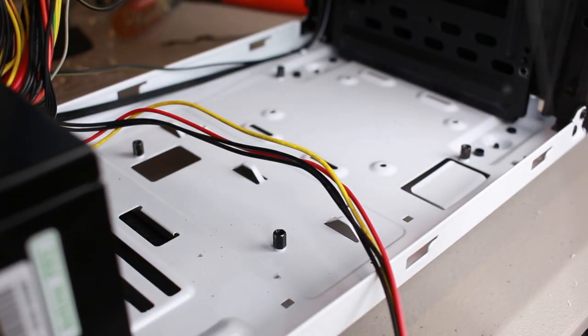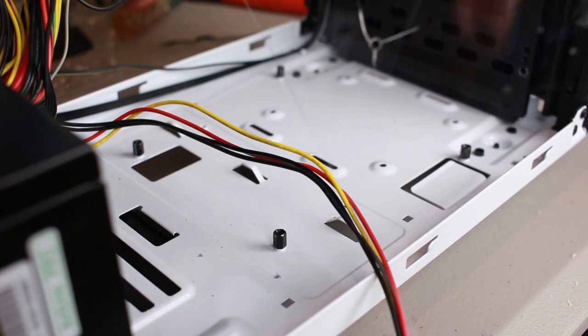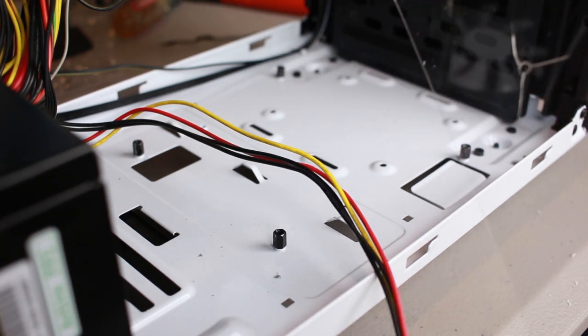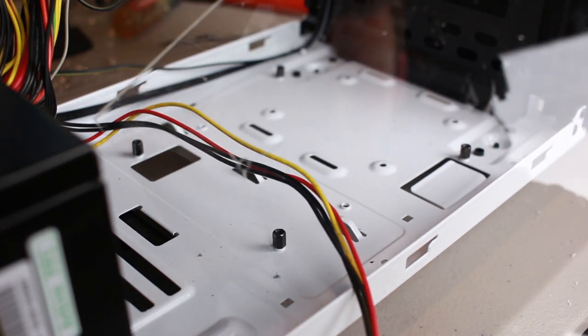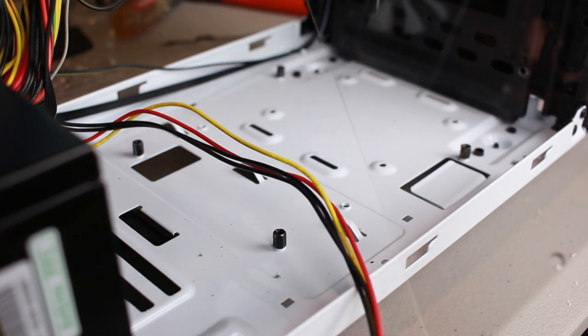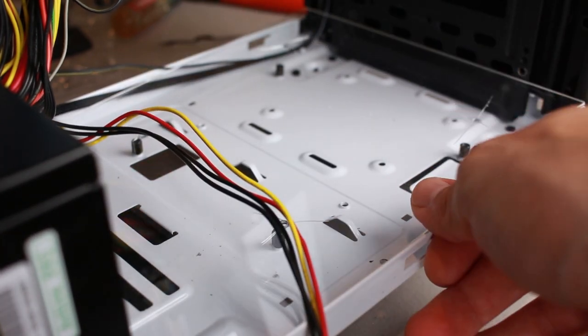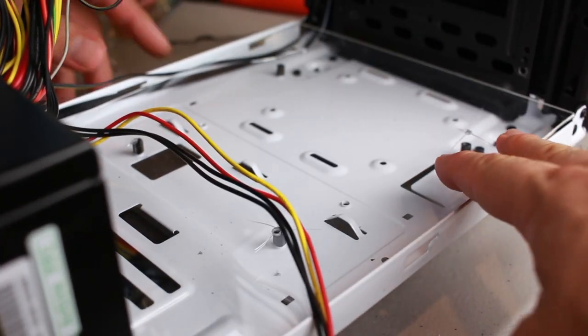So we got our acrylic piece back here. You notice there's some cracks in here. The reason why is because I tried to bore the holes a little bit wider just because the screws wouldn't fit. I finally had to move up to a 1/8 inch drill bit to get them in. So you can make a joke in there if you want about drilling and trying to get it in. If you want, that's up to you.